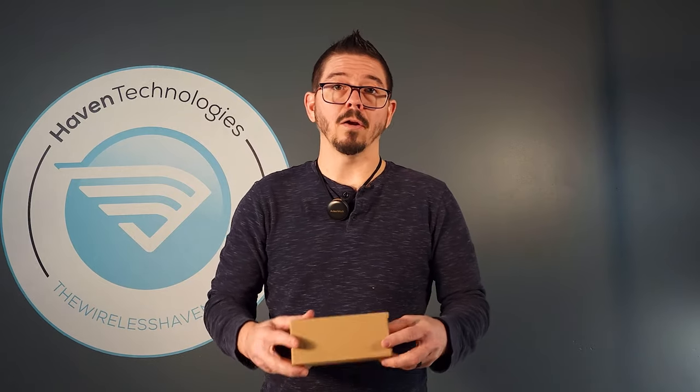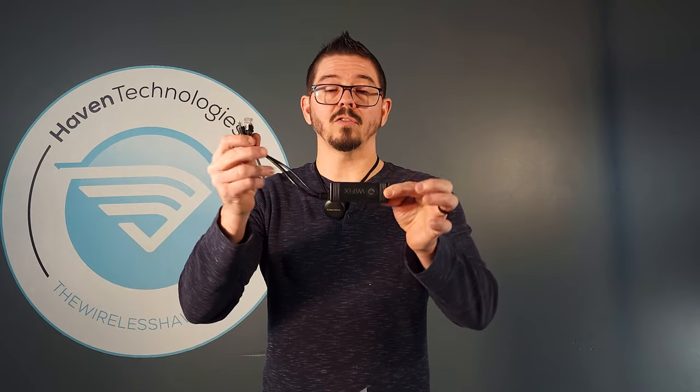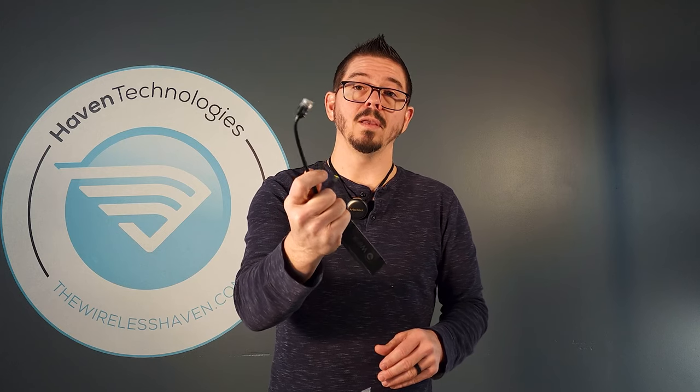You also get our Wi-Fiq 72-watt PoE injector. This puts PoE power into the Ethernet cable from an indoor standard plug-in. It also comes with a cable for the injector. The Invisigig is not currently PoE powerable, so the kit comes with our Wi-Fiq 3-amp 12-volt PoE step-down splitter. It takes 48-volt PoE input and splits off the Ethernet data with a 2.1-millimeter power plug — 12-volt output, maximum 3 amps.